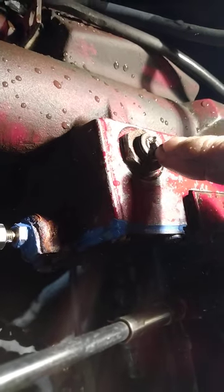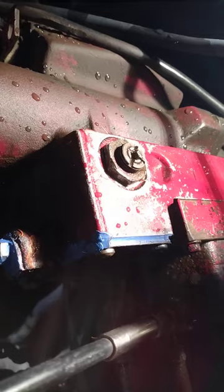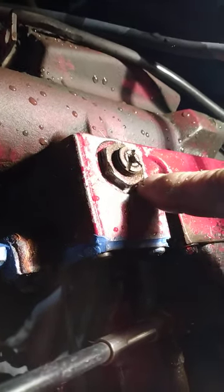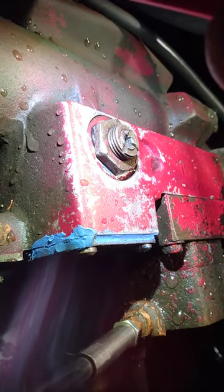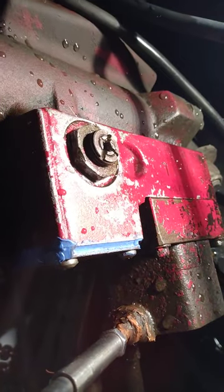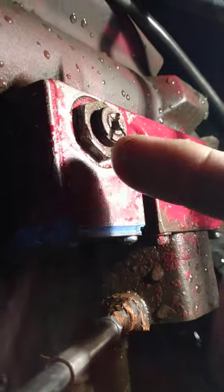That's why I'm saying you've got to have the right depth on this. I literally turned it from eight o'clock to ten o'clock — bam, the blade came down, that's all it took. Got back in the cab, up and down worked great, left and right worked great. But when I tightened the jam nut back up, there's an o-ring underneath — you can just see it right there — and snugging it up was just enough to tweak that o-ring and it started leaking fluid.